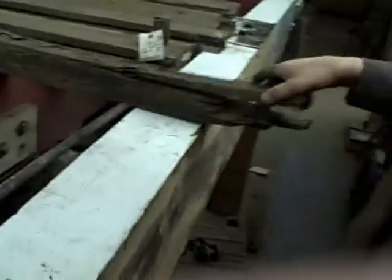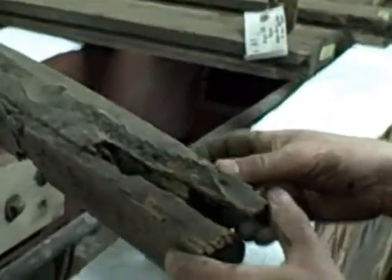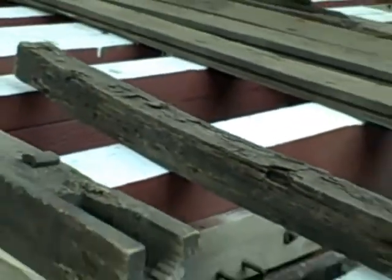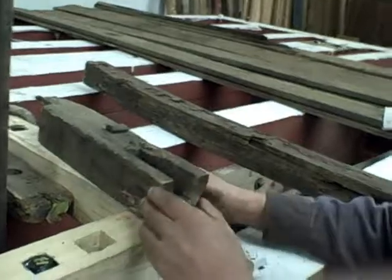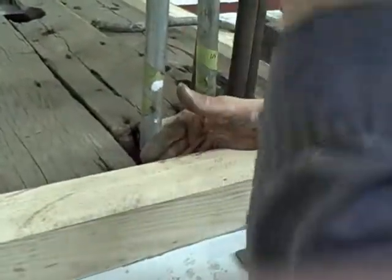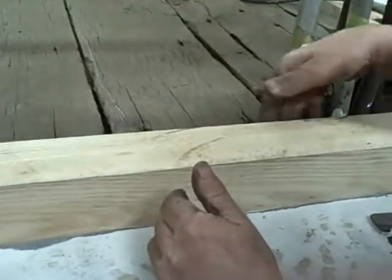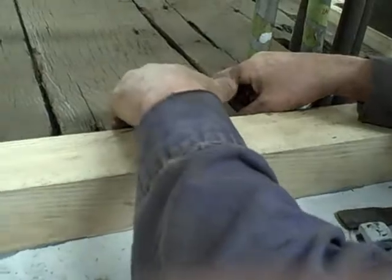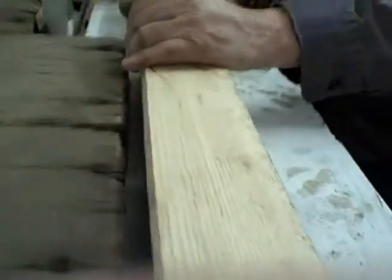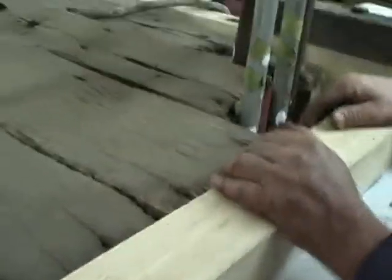This is another piece of the cab sill. You can see it suffered. We had enough by looking at some of the old ones and by there's still some stuff inside of the cab wall. The cab wall will come down here — the sheathing on the outside will go vertically here, and then there's wainscoting on the inside which will go here. So there's supposed to be about a three-quarter inch space, which we just set these in yesterday. So we might as well talk about the flooring.